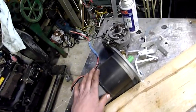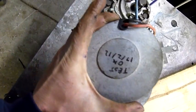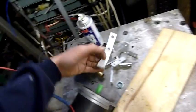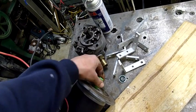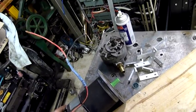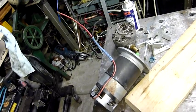I'm also using a 24 volt DC motor, and I have a speed controller unit somewhere else that will couple up at the end. I've tested it - I think the bearings are just noisy, it's been for a bit of a swim like a lot of these ones that I find. So I'm just basically going to put little legs on each part, bolt them to a piece of wood, and couple it together using a bit of radiator hose or similar. Just parallel heater hose - that's all I really need. I'm not building back pressure, I'm just transferring fluid, so hose clamps and a piece of hose joining the two together is enough of a flex coupling to do the job.